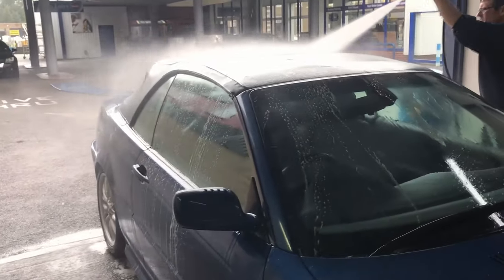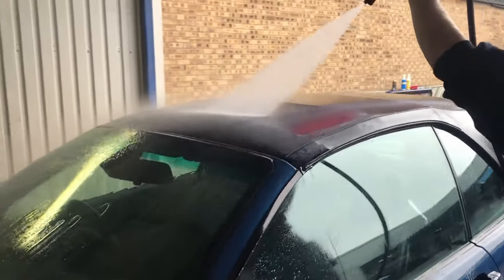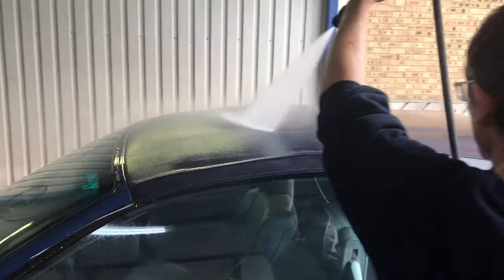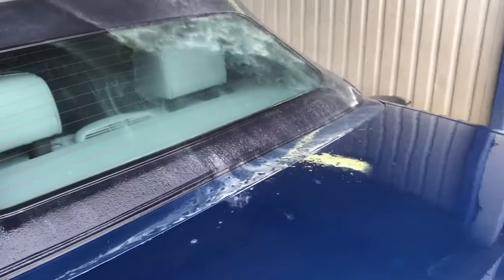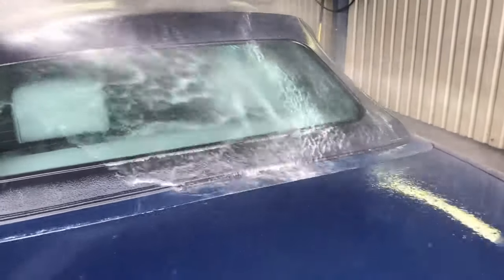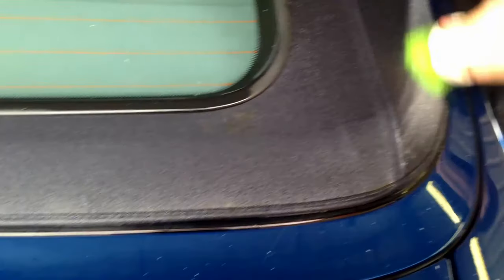So how are we going to make it like new? Well, you can't go brushing and scrubbing it straight away because it has grit in it — you're going to get a certain amount of wear in the roof, and obviously we want to avoid that. So what we're going to do first is put a chemical on there that will break down the organic stuff that's holding all the grit in the roof. We'll soak it first, leave it for a little while — we've got enzymes that eat into it — and then we're going to jet it off before we put a brush anywhere near it.